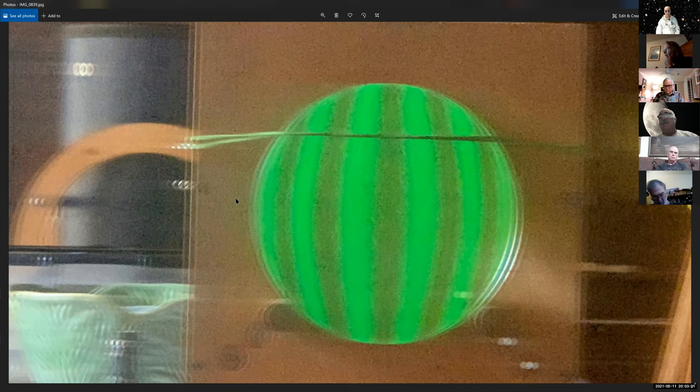So, not very much. So he wanted me to stay completely away from that. In the second session I did, I just ran a small little W thing. Just imagine a 4.5-inch lap over the top of that mirror. I'm going to take it right and left, up and down, very, very shallow, maybe an inch, traveling an inch up and to the right, the left, just an inch, and using the figure of a W. So it's going to be a small W going to a slightly larger W over to the right and get smaller again. And as you're doing that, you're walking around your work surface and doing that same type of correction. You're walking around the barrel a couple of times. So I did that in the second session.